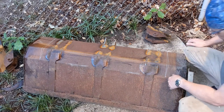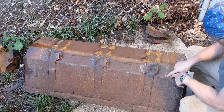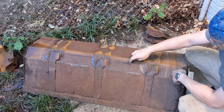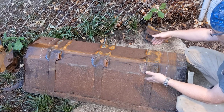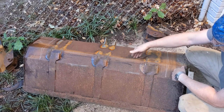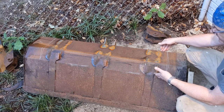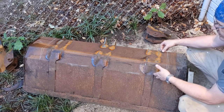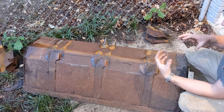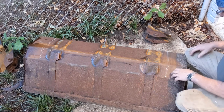It's now the next morning and I've given it some thought overnight. I'm going to go with a little bit different plan. I'm going to cut here on these white lines — slicing the middle of the protrusion I want to remove — and then cut here on the end lines. After slicing these lines, these will now be tabs out in space. I'm going to put it in the shop press, put some plate steel over it, and get one tab going before the other so they interleave — then press the whole thing flat. It'll save a little welding and I think it will be a stronger result. The ends of the bucket stay at full depth; that multi-dimensional shape gives a little more rigidity than a plain rectangle.